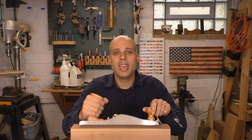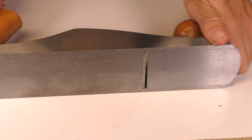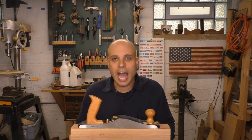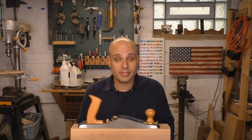In addition to all of this, it's also got a couple of really thoughtful features. For instance, the adjuster is a Norris style, and that combines depth and lateral adjustment into a single piece of hardware. It's pretty easy to use, keeps things simple, keeps costs down. This plane also has an adjustable mouth, which is really important in a tool that's supposed to do so many different things. A fine mouth helps you fight tear-out and take fine cuts, and a wider mouth helps you take medium and rough cuts for stock preparation. I really did not want to like this plane when I first got it — and I don't like it. I love it.